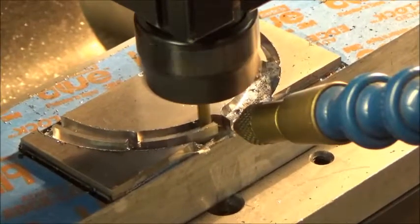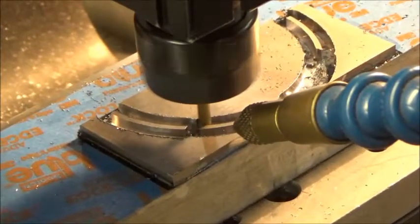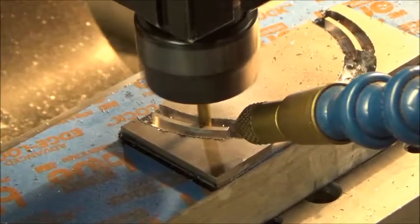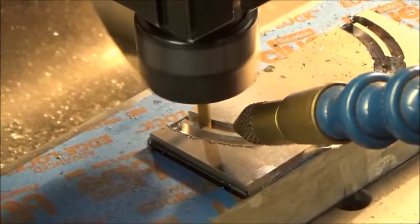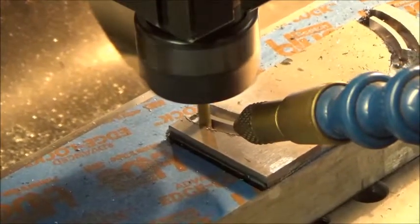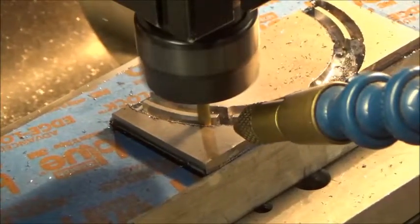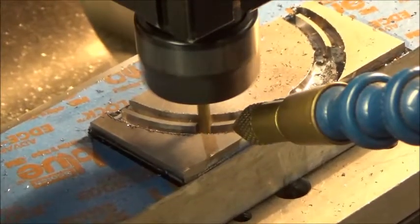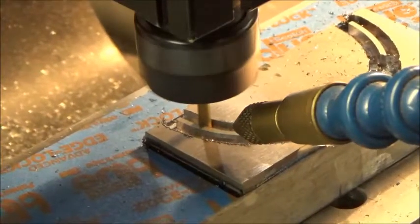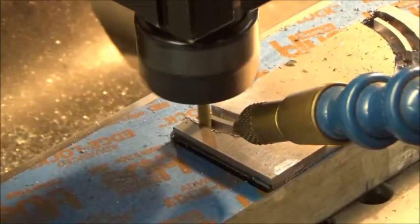It's pretty smart — before it started cutting the tabs, it only took a thousandth depth of cut. It knows it's got an oddball number to deal with. I can sit here and watch the Z-axis — you can't see it, but I can see it cut the tabs. It does a tapered cut into the tab and then it tapers back down again. I have the option to make a tapered cut or a square cut. There it goes back down — so the tab is 6 thousandths. That's what it is.